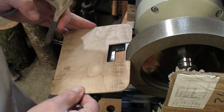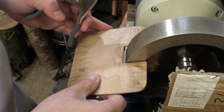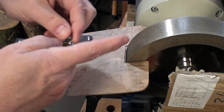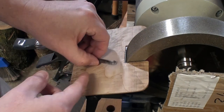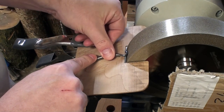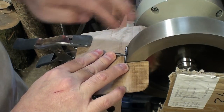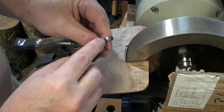I've taken a piece of plywood — a piece of thin wood — and just created a cutout that fits around the wheel, and I just hold that on with a little clamp. The angle set on the wheel is: if I hold the hook upside down, blade side down on the flat, then that wheel will spin and rub that bevel right there.